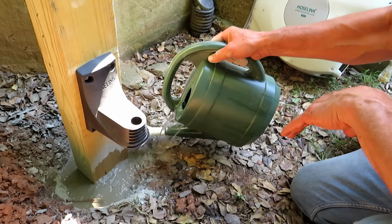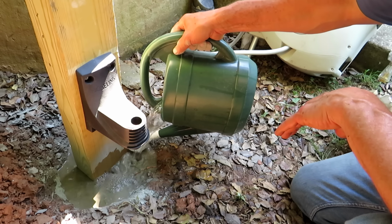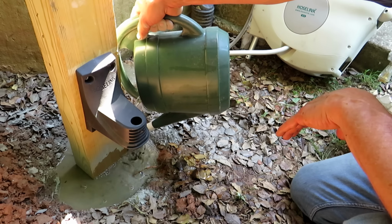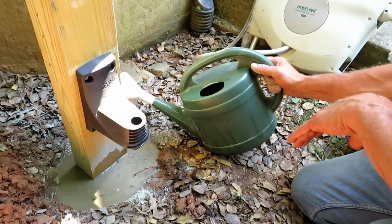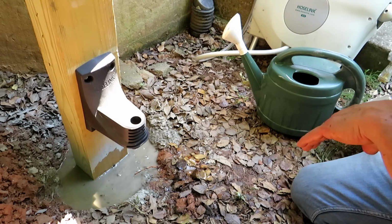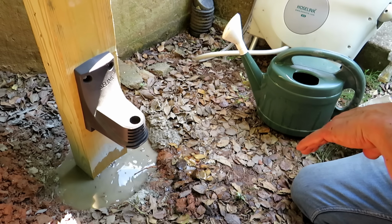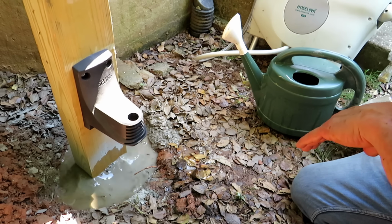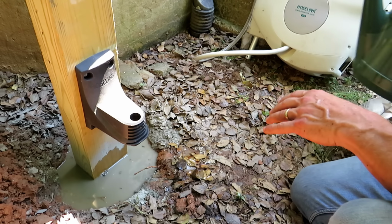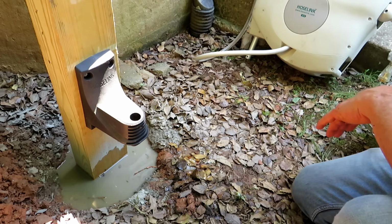And you don't need to mix this. You can actually just put in about 2 gallons of water, and that will set up. Give this a little bit of a wiggle. The water will fill up in the air pockets. And that's when you kind of just sit back and you just make sure that looks straight. You have time, you have a good 15 minutes to adjust this.